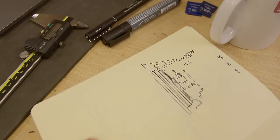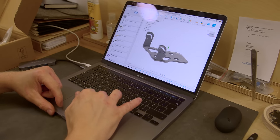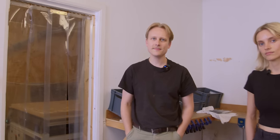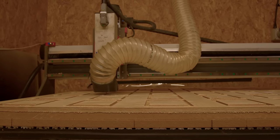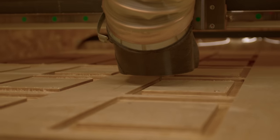So how do we go from something that Max designs to something you can actually do? Max already has a load of experience designing cameras. He'll design everything in CAD on the computer first, then hand those files over to me, and my job is to make the most efficient method of manufacture. I'll take those designs, figure out the thickness of plywood that it needs to be machined on, figure out the depths of cut, and then once I've done the first few prototypes, figure out how to get that running on a day-to-day basis. Right now this is the rotating back of the 4x5 camera, and I can get 36 out of a sheet. Depending on the part, I can get up to 112 parts on one sheet, but it depends on how big the part is.